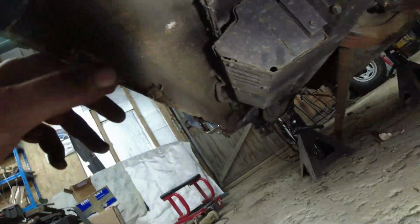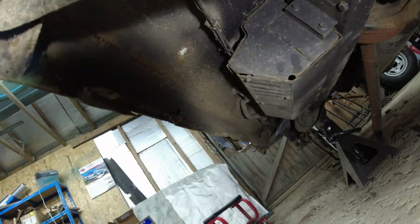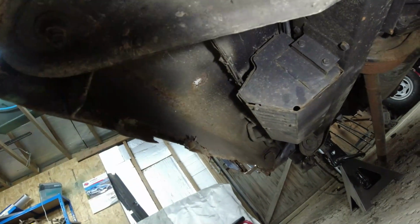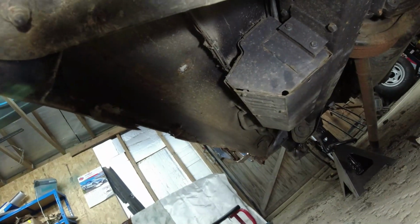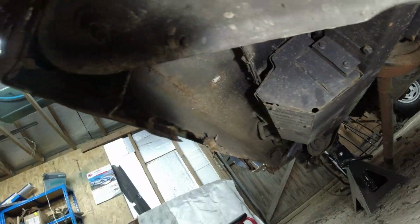Never noticed that. Yes, I do think that we don't actually need a complete sill here. It's all very good where it meets up to the floor, but if the customer wants to put a complete inner sill on it as well, then so be it. But by the time we put two mounts on it, we might as well. But then it's a lot of bloody spot welds to drill.